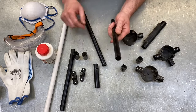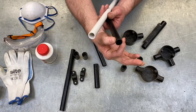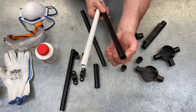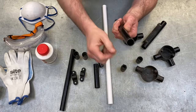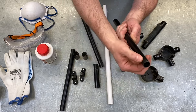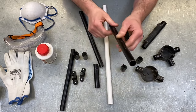If we talk about the sizes of plastic conduit, remember in both cases it's the diameter — the diameter of the actual conduit itself. So it's not millimetres squared, it's not the area; it is the diameter of the conduit. Exactly the same as in steel, the four common sizes are 16, 20, 25, and 32 millimetres — often used as an exam question.